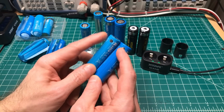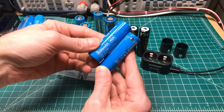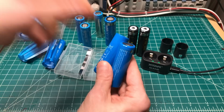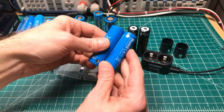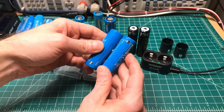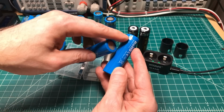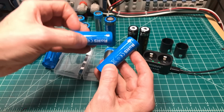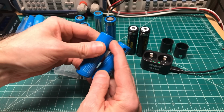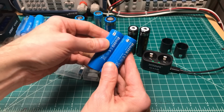This is also a problem if you have series-connected regulated vaping devices, and typically you'd see one battery up, one battery down. If these two metal cans touch each other, if they're connected in series, and in most regulated vaping devices with more than one battery, they are connected in series, if the two cans touch, one of the cells gets short circuited and can catch fire or explode. Now, most of them are set up where one is like this and one is like this. So the odds of these two bare spots touching are low, but there are some that are wired like this. And also, if one of these is worn out up here and the other one has a bare spot, they can touch. It doesn't mean it's going to happen, but it just means you're increasing the risks that something bad could happen.